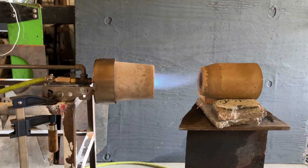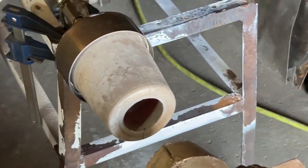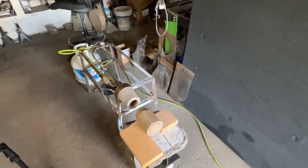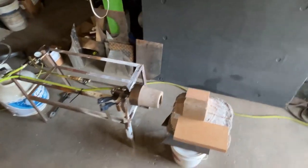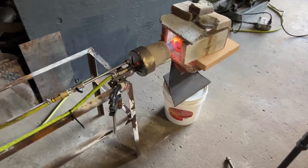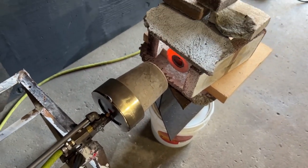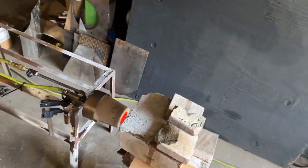I'm not going to bother painting it yet. I also decided to burn out the mold of this other piece with it, so I turned this thing on and off about 10 times today. Turning it on and off is the most destructive event — when it's running it's really no big deal; it's the expansion and contraction. We'll let it cool down completely.